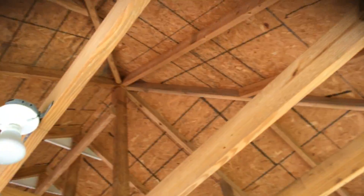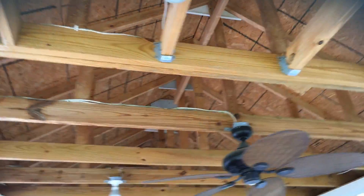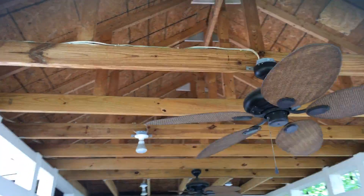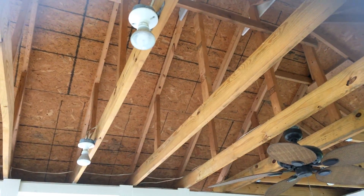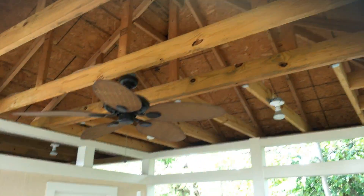The bulk of what we'd be looking at is the ceiling — she would like a light sky blue, so we'll do that. We'd also do the trusses or beams in that lighter trim color, and it continues back this way as well. Most importantly, we need to full oil-prime the OSB material in the ceiling, because if we don't, tannins from the wood will bleed through. Same thing with the knot holes in the beams — those need to be primed separately, or they'll definitely bleed through.